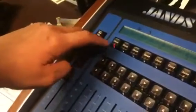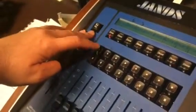Then the next thing you do is hold down the monitor button and look at the screen in the middle. Along the top, if you hold the monitor down, it says output, program, cue list. Cue list is what we want — it's the third button. So while still holding down the monitor button, we hit cue list. And if we look at our big screen up here, now our cue list is up on the big screen, right here in the first position. This is where we fire our cues from — that's all you have to do.